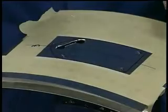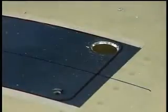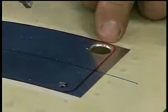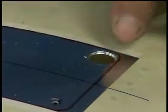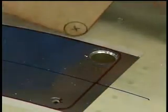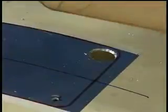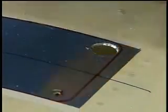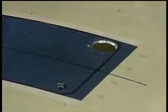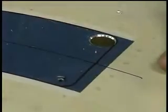Another way is to cut with the unibit. I've used the unibit and gotten very close to the line — if I take away the ink from the line that means I've got a clearance on the pattern. I want a clearance of 20 to 40 thousandths of an inch around the piece, so I can cut up to the ink at this point without doing any harm.